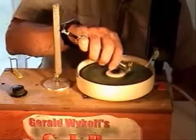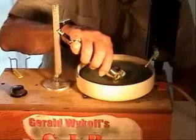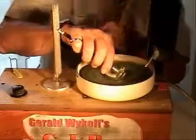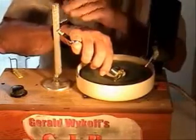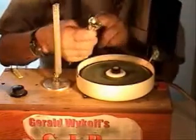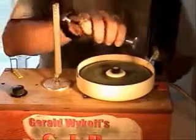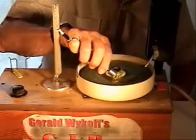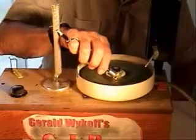I put the peg into the angle, which is 42 degrees. This is already mathematically established, so I don't have to worry about it. The length of the peg and the stone are proper, and the jamb has been set at the proper elevation, so each of the facets is coming off very neatly. I used a special index gear I made on my own little metal lathe so I would have a nine-fold index gear for cutting Italian Florentines.